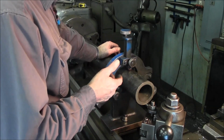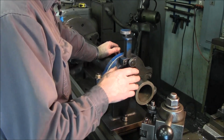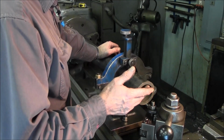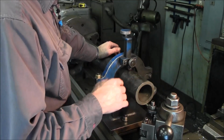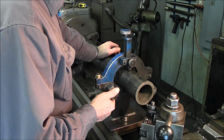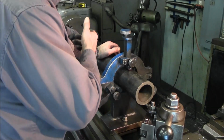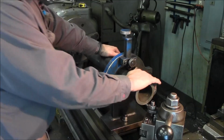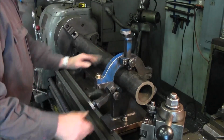And then we'll pull it out, and we're going to get the cradle set up, and then we're going to start figuring out our placement for our boring bits to the bar, and clearance and a couple other things, and we're going to start doing the mill work on the boring bar. And then we'll be able to slide the boring bar into the assembly here, and that's kind of the plan. So we're heading that way.